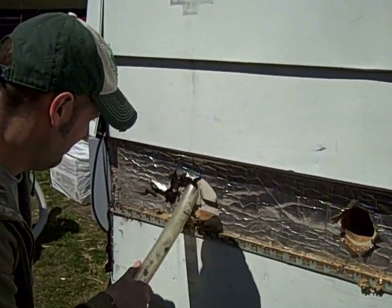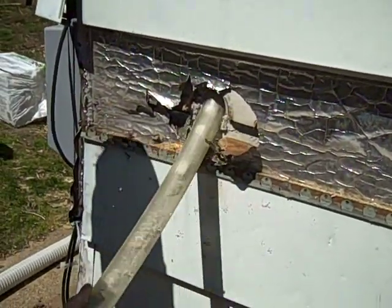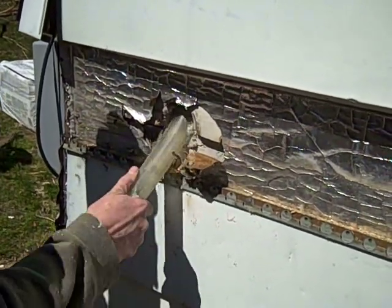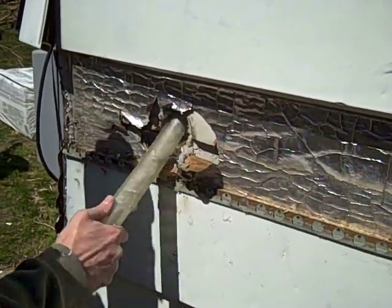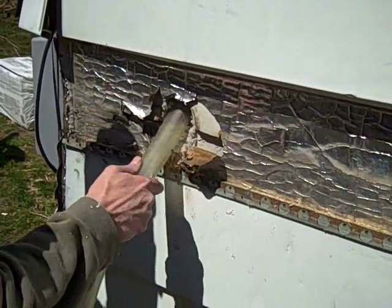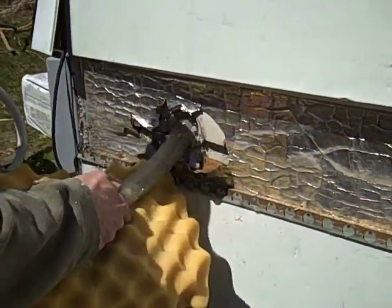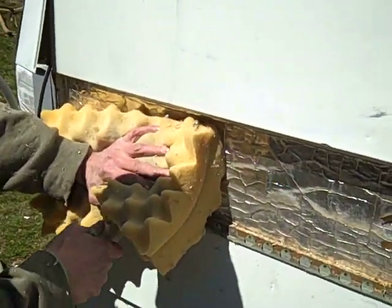You will first hear a sound change, and that is a good sign — you can see the insulation stop. Once your insulation stops, you want to back out on that tube a little bit. We have got our tube marks, so we are about 2 feet in the wall, now about a foot. And then we are going to cover with our foam.